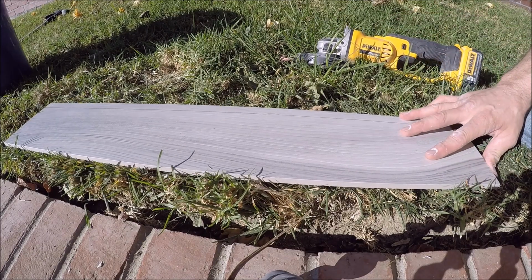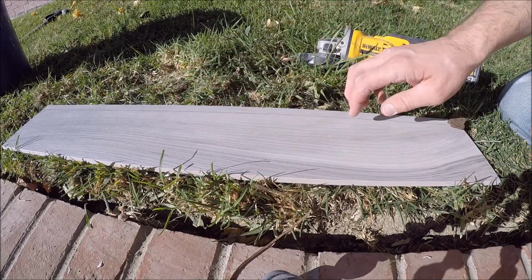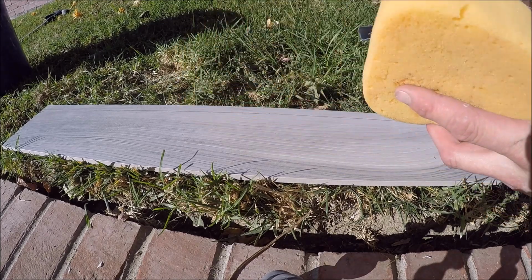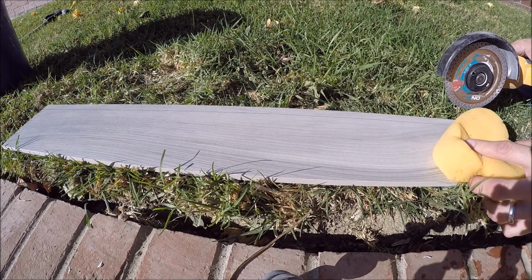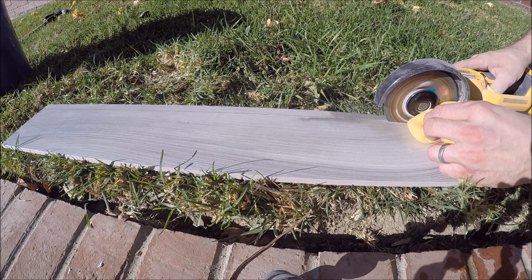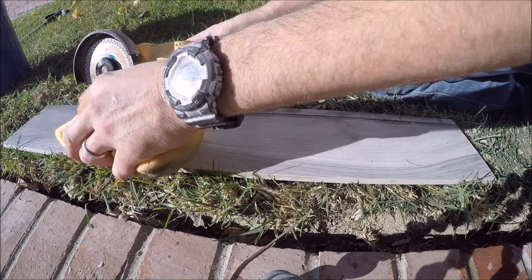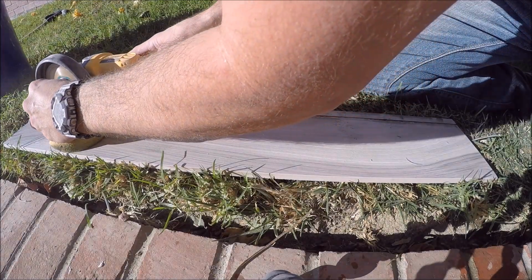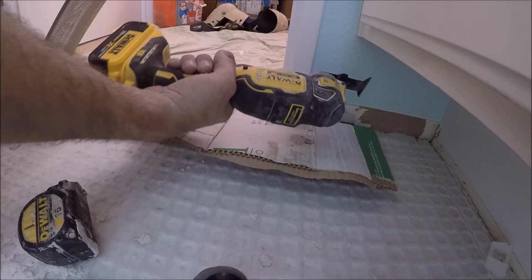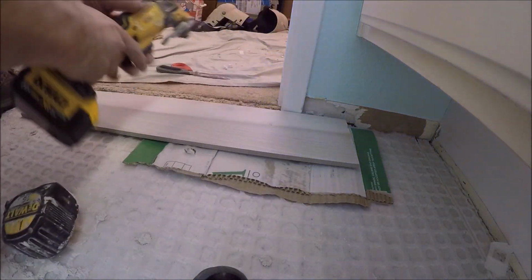Now, no wet saw necessary today. A grinder and a snapper, we can install this bathroom floor. I've got a rip here. I'm going to use a cordless grinder with a Monolith blade and a wet sponge. Hit it with a rubbing stone, good to go. Use a multi-tool like this with cardboard in order to trim your casing down.